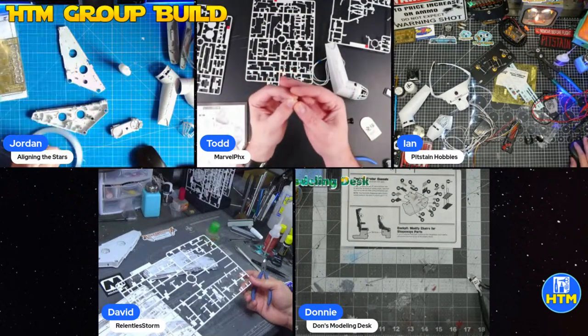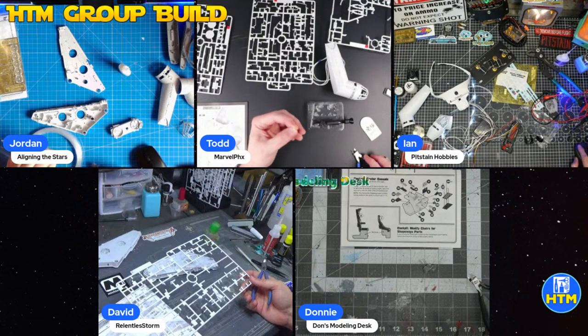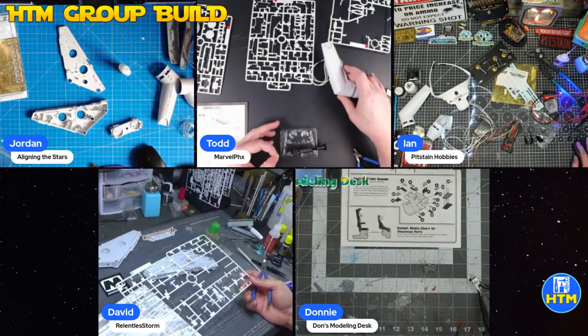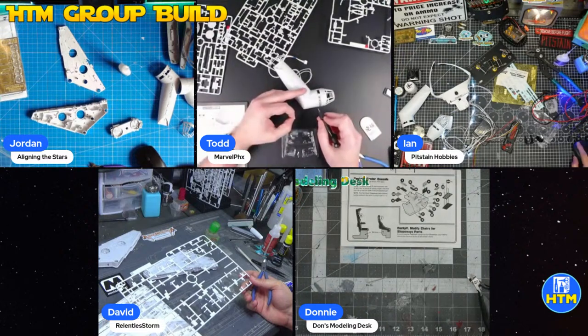I returned one before that one. I found one that looks identical, but it's only 5 amps. It's 30 volts, but 5 amps. Is that a big deal? 5 amps is... Yeah, you're going to be pushing 2, 3, 4 amps sometimes, depending on what you're building. Like, lighting the Enterprise D part work, I'm already over 2 amps just on the saucer. Wow.